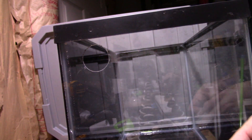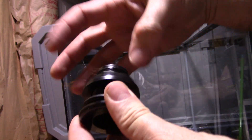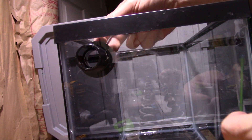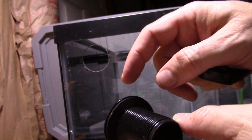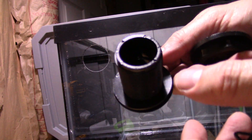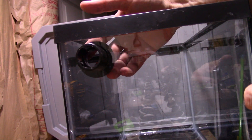When you put the bulkhead in, you have to keep the gasket on the flange side — simply slide it through the hole. Some people like to put a bead of silicone around the inside, but I'm not going to do that for now. I'll put all these on, leak-test them, and if I'm having any problems — I do have a few that chipped a little bit — I may go ahead and silicone those. So: gasket on the same side as the flange, on the inside.